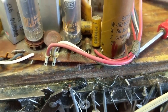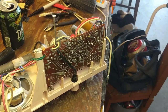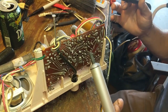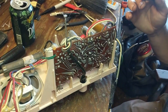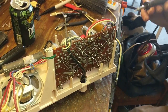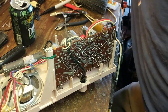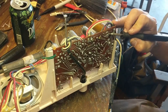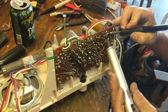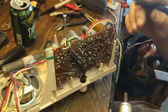I'm going to use my little solder sucking tool — I know it's a gross name — to remove this whole thing. Then we'll put two new electrolytics in there. What I need to do is take my solder sucking tool and heat up each of my lugs until I get the solder nice and molten, and then come in here and pull it out. You see all the solder that just came pulling out of there?